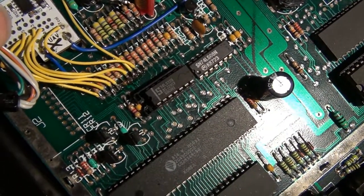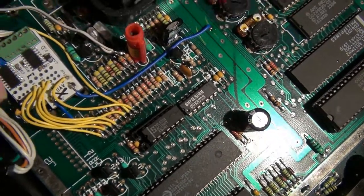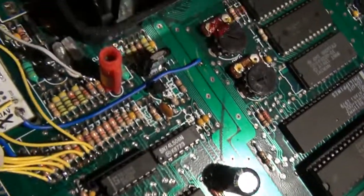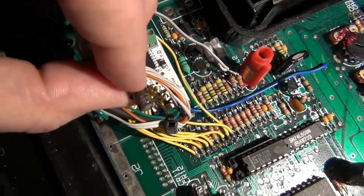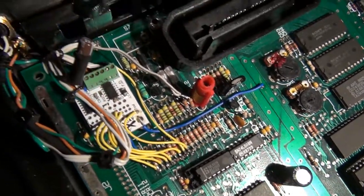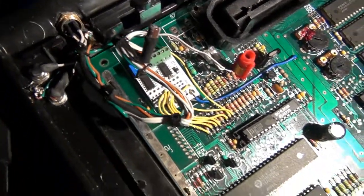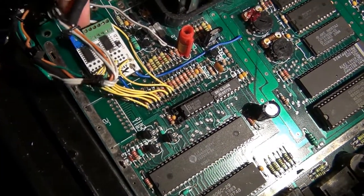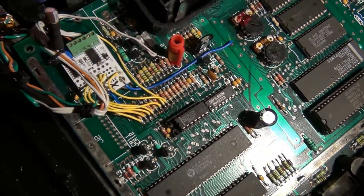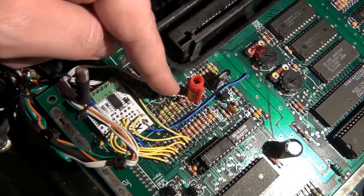And let's see, I did this a while ago, so let me see if I can get the value on this particular capacitor that I'm using. Looks like a 10 microfarad 50 volt. Of course, you don't have to use a 50 volt. That's probably what I had on hand. You just needed a 10 microfarad capacitor. And again, that's what I had. And that's gonna come off of the positive side of that, if I'm not mistaken. Yes, I'm looking at this. Positive side of that needs to come off of the connection from your two resistor points.